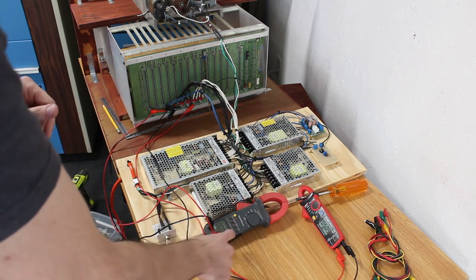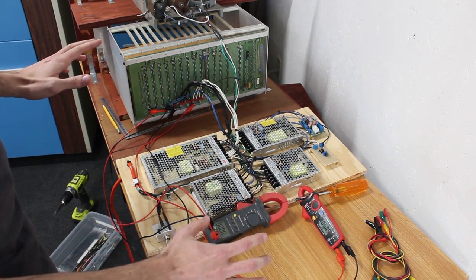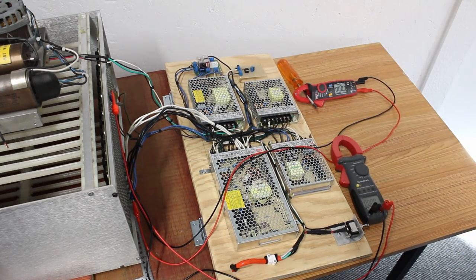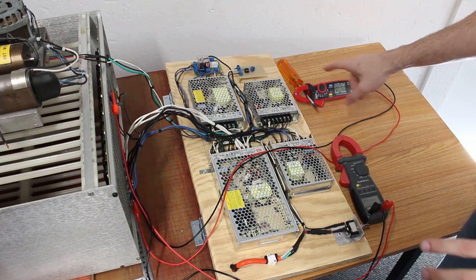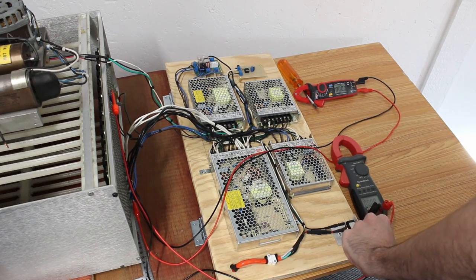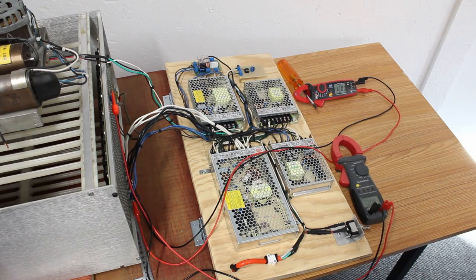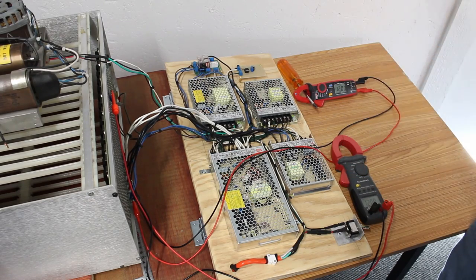Well, I've got 5 volts but I don't have negative 12 volts — that's not good. Nothing seems like it's going up in smoke though. Simple mistake: I just had the common and the normally-closed on this little white relay wired up backwards — I misunderstood the data sheet. With two multimeters now on negative 12 and positive 12, we flip the switch — I heard the relays click, there's plus 12, there's minus 12, nothing's backwards, nothing has gone up in smoke, all three voltages come on at exactly the same time. That is epic.